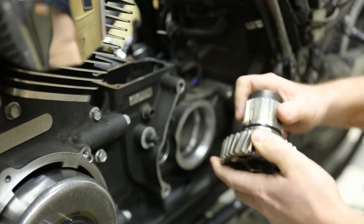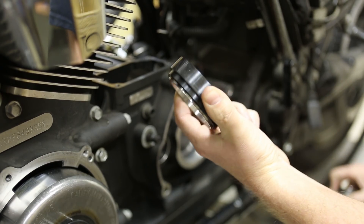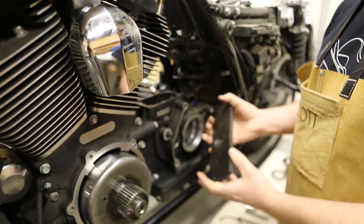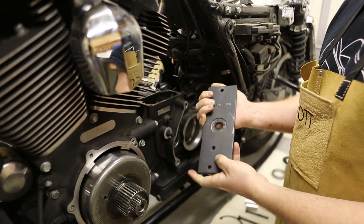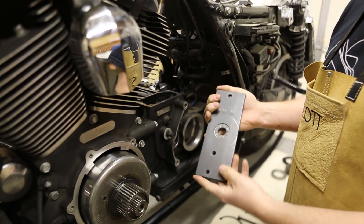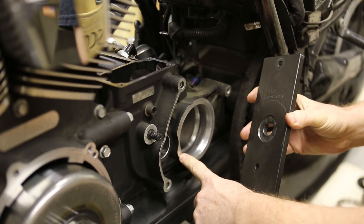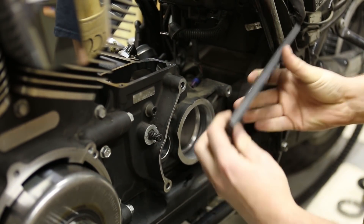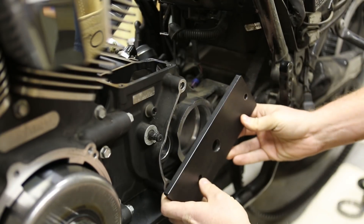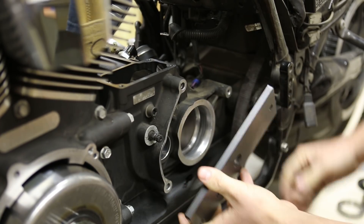This is the adapter kit here that we're going to have as the first item installed. The first part we're going to get is our tool plate here. I'll show you the plate because it's crucial on which way that this goes. You want to have the counter bore facing the case and then you want to have where it's two holes into your left hand and down below. So you won't be able to see the counter bore or the writing. That's important how this goes.